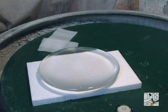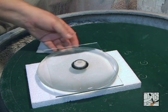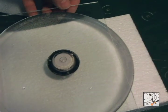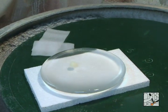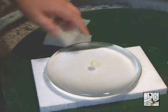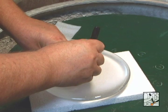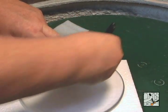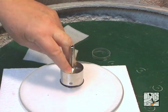To find the center, I will need to make it level. I have a bubble level here — if you can see the bubble, it will move around until it's in the center of the ring. Now to find the center, that's easy. These are the bearings we sell for Reciprolabs. You can find a marble, ball bearing, or these. Once the bubble is in the center of the curve, I will hold it in position and make some marks around it. Then I can position my drill and mark around it — that will be my visual guide as to where I'm drilling.